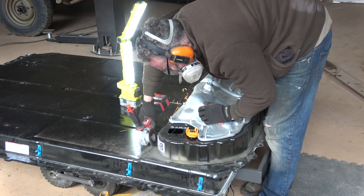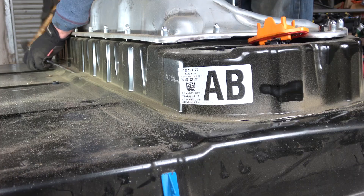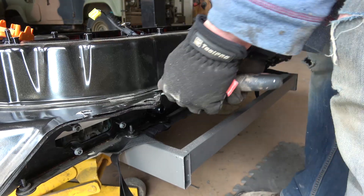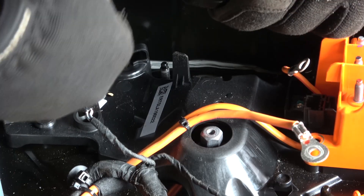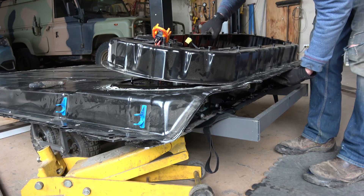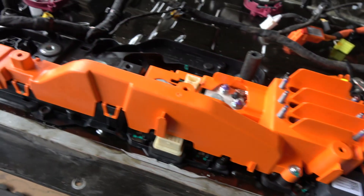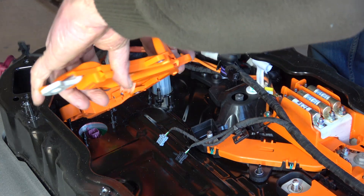At this point the outer frame of the penthouse starts getting in the way, so it's a good idea to take it off now. This is both glued and welded on, so I need to go around and grind and cold chisel — or in my case, cold screwdriver — the weld free, then use a scraper to release all the polyurethane. Take care around the back of the penthouse because the components are hard up against the case and you don't want to damage anything. With this removed, you can see how much easier it is to get at all the bus barring and other final components.